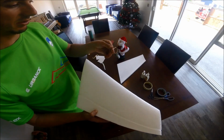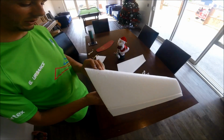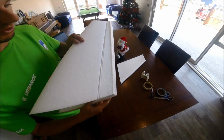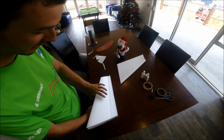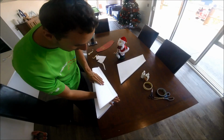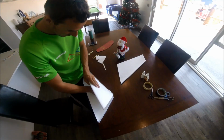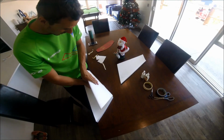it has melted the cores into the beds, because as it's cooled down it's re-adhered itself. So we've got to be real careful with the trailing edge, especially this along here, because this tends to stick, because that's where the wire exits the cut. So I like to get my hand underneath and try and slowly pry the back edge off without ripping too much of the foam.